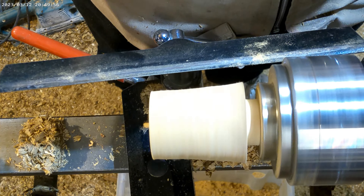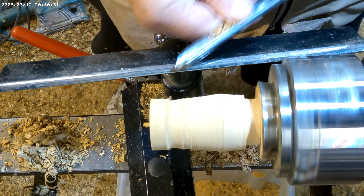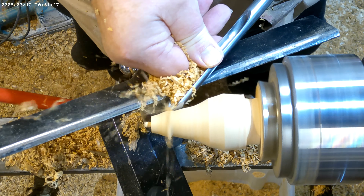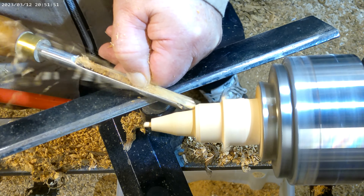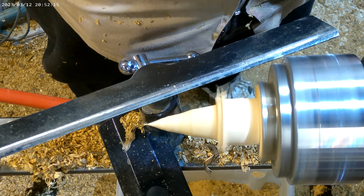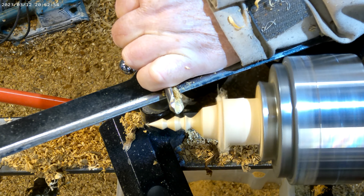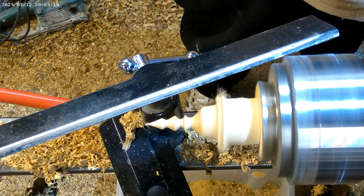This is going to be my finial — just another one of the branches off the cherry tree that my neighbour so nicely gave me. I've still got way too much diameter on that wood so I'm just quickly ripping that away. Getting down — as all finials do — to end in a point, so I'm tapering that down at the moment. You do need to make sure you've got very sharp tools when you do this, because it is quite thin and very delicate. If you've got a blunt tool you end up pushing much harder than you need to and you could very easily end up snapping the finial off. So it is important to have very sharp tools. That's the end of it done.